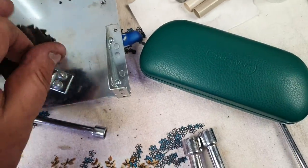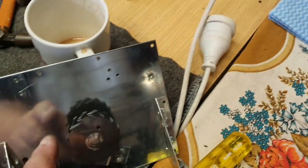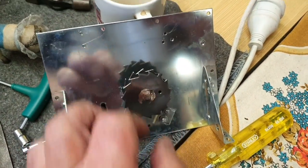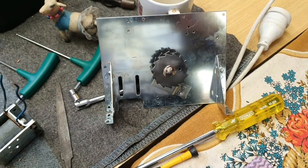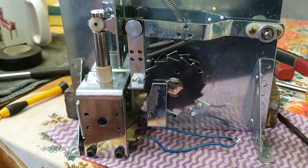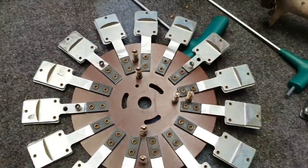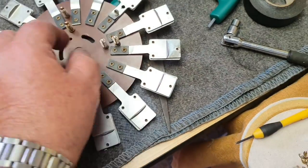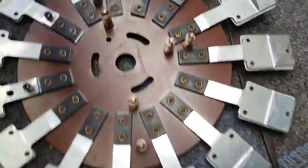Here's all the parts coming out of the ultrasonic cleaner. Quite happy with the way that's all turned out. You saw how grungy that coil plunger was before. There's the escapement wheel — just gave that a bit of a polish on the buffer. The shoulder screw for the drive arm. So, if we put the escapement wheel in now — and hopefully it will spin well. Yeah, look at that! Barely moving before. So that's what you need to do to get these things going sometimes. We've reassembled the step unit — it's come up quite nicely, or the roto unit. We've repaired the targets themselves, put new springs in all the snowshoes, cleaned them, and we've pop riveted those few ones that were faulty.